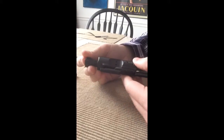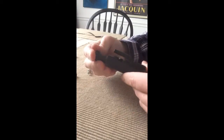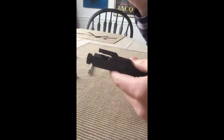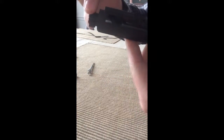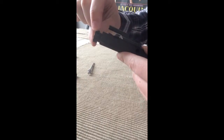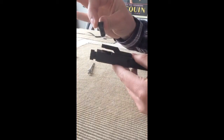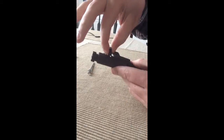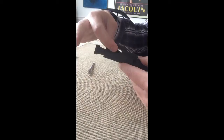Put it back in there. I'm going to have to twist around a little bit to get it to seat — kind of fiddle with it. There we go. Push it in, and once it's in, notice it's fully pushed down all the way back. You have to line up the bolt cam hole, so we'll take the bolt cam pin and just drop it right down in there. Push. Then we pull it out and rotate it 90 degrees. That's in there.